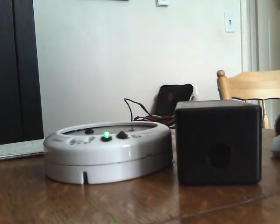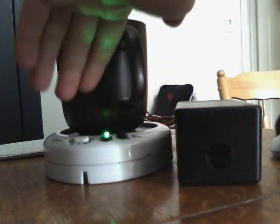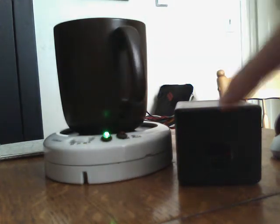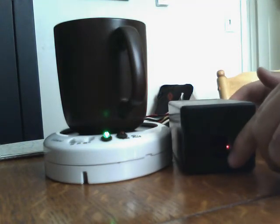You can see this is a fairly new project. It's a really nice green. You can see how bright this green LED is — the blue one's even worse. These things are crazy bright, and that actually is not nearly as bright as it could be. I hate how bright some of these LEDs are and how hard they are to mask. So what I did was use an analog write at a level of 10 instead of a full digital high. The RGB is pointing to one to three of the PWM pins on the Arduino, which is nice because it allows it to not be so bright.